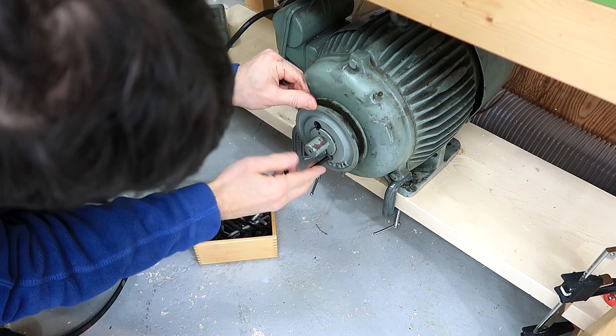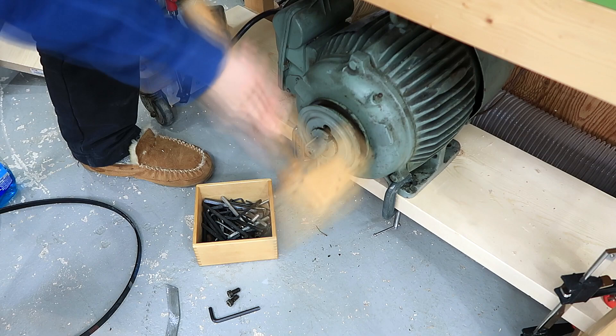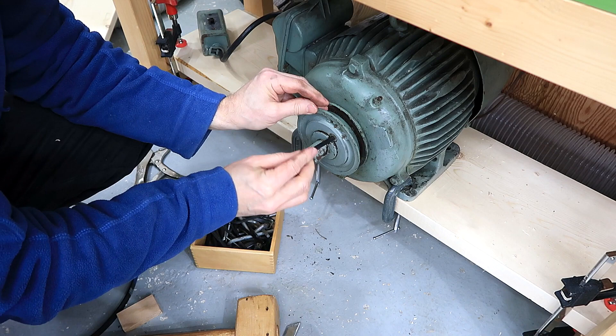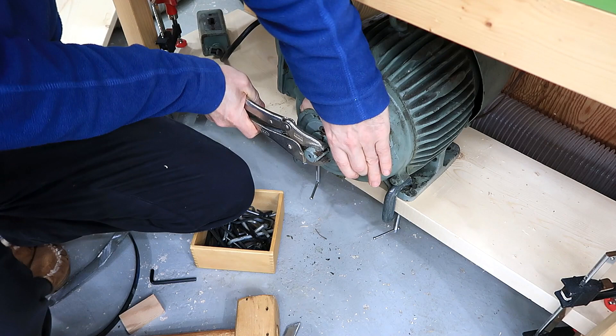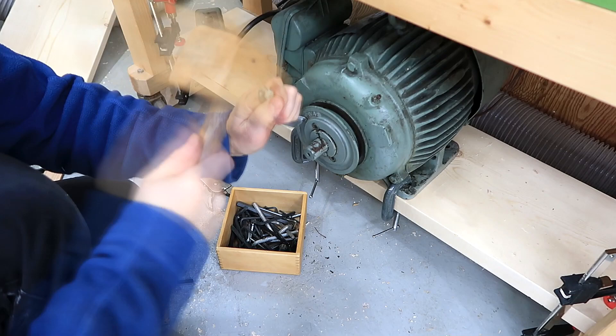Now, how do I get this collet to slide off the shaft? I think it's painted on there. Just trying to loosen that collet by hammering it back. I just realized those screws are also useful for forcing the flange off a bit, so I just have to put them back in and then turn things a bit. I know I'm banging up the shaft here, but there's paint on it anyway - it needs to be cleaned up. It's not very often I get to use my gear puller.